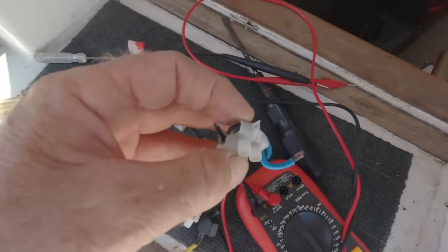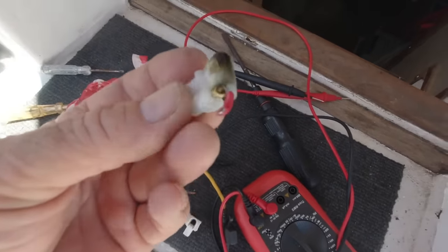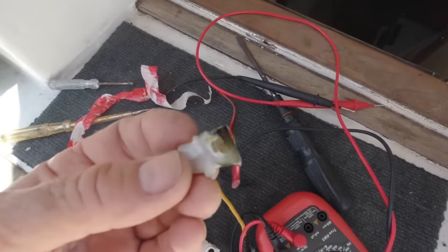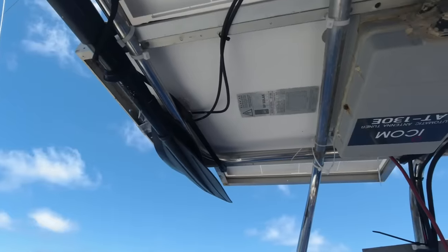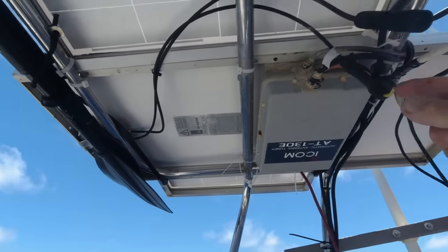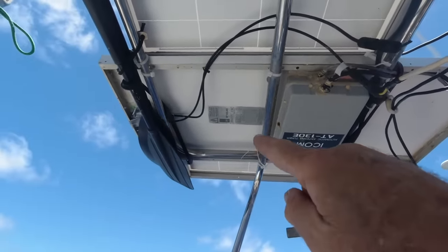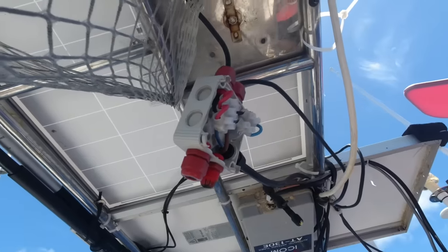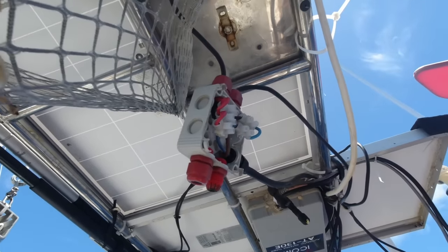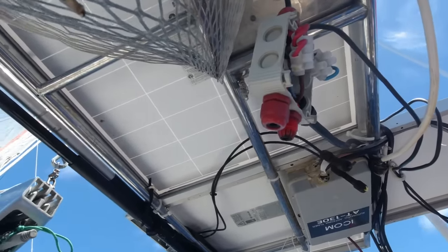I don't know if you can see some of this stuff, but serious burning. I was right, there were at least 2 panels not working out of the 4. That end one, which has always been bad, I've cut loose now, so it's no longer in the circuit. That was what was causing all the problem. Burnt a load of stuff in this junction box up here. So I'm currently rewiring. All this is going to get changed out. So before anybody grumbles at it, it's had its day.